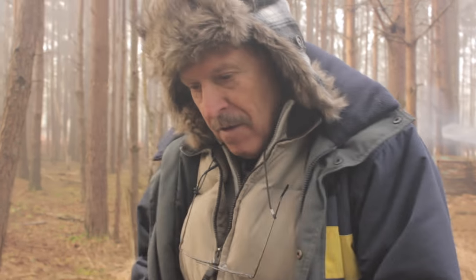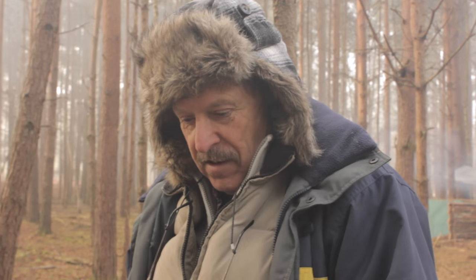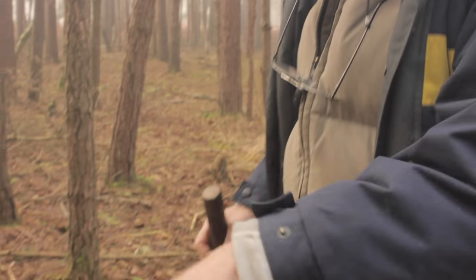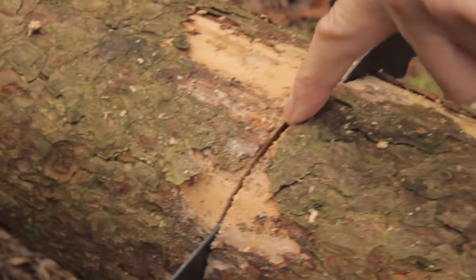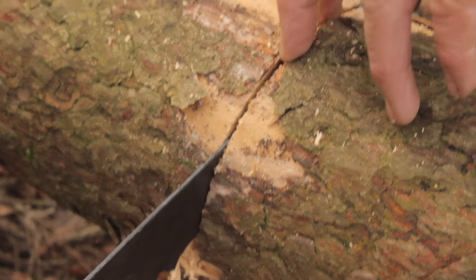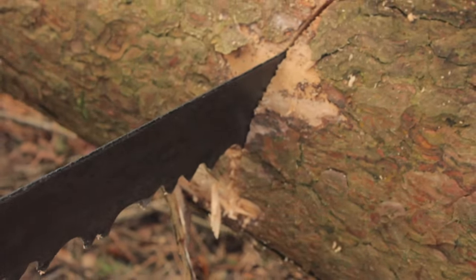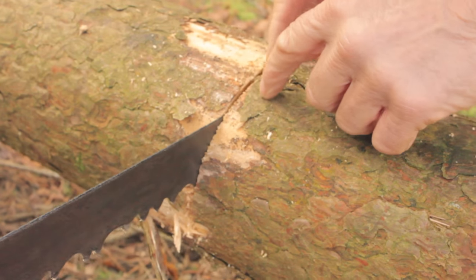It is, really. It feels like you're getting back with your ancestors. But the problem is, we're just starting to get a pinch. We're halfway through this already. Now, I really don't know. I'm wondering if we should make a wedge or maybe tap your axe in there just to split that and open it a bit, because it's pinching below the blade, isn't it? Maybe we should have put another log under here to take a bit of strain and stop that springiness, because that's closing the gap.